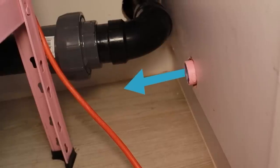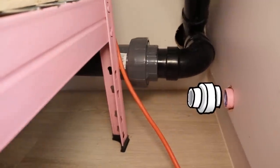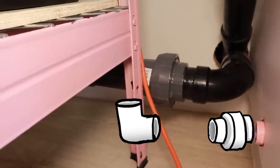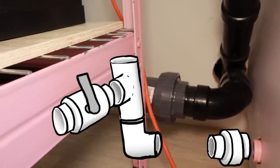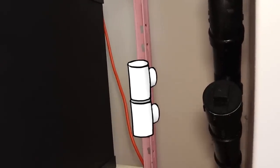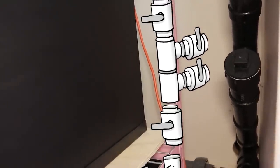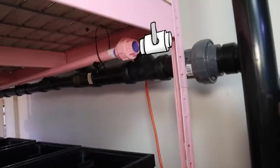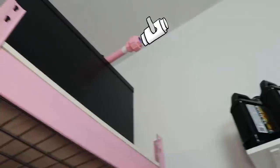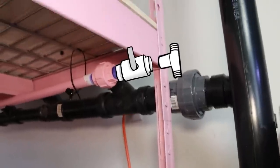I'll give a little explanation of exactly what I'll be doing — I even made myself a little sketch. The water will be exiting right here. I'll add a union in case I need to disassemble the whole structure, then it goes over to my tank rack. I'll add an elbow, a tee, and a ball valve. The next segment will be a small manifold — I'm putting two tees on this section that face the wall, each tee will have a ball valve right after it, and a ball valve on each side. Then I'll finally connect the plumbing to my large manifolds — the ones that actually bring water into the fish tanks — and each one will have its own ball valve. For the horizontal pieces that control water flow, I'll be using hose barbs and some hose to attach those.